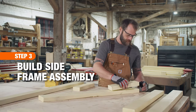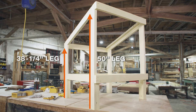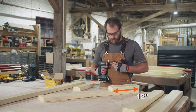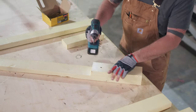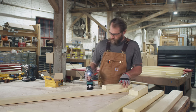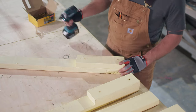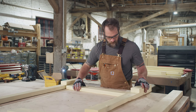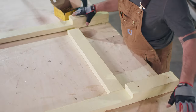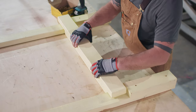The next step is to build the frames for the sides of the coop. Each side frame consists of a 50 inch and a 38 and a quarter inch leg. Using a drill or impact driver, attach a 12 inch two by four vertically to the bottom of each leg with two and a half inch screws. Then place the 29 inch board horizontally between the legs. Next, attach a 33 inch board on top between the lower legs and attach with screws.